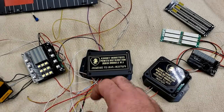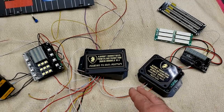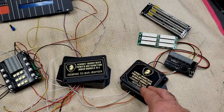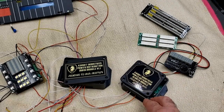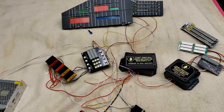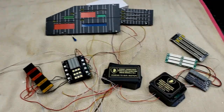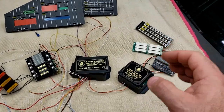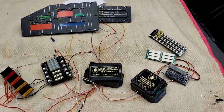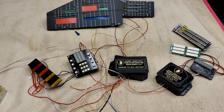As I stated before, there's a 12-volt signal that is emitted from my version 3 main module. When it is sensed by my remote module here, it will energize the electronics. And what that actually does is, when the countdown is complete and the main dash is on, the upper console, and in fact the lower console, if so wired, will come on simultaneously. No extra toggle switch for the top, no extra toggle switch for the bottom, not needed.